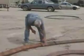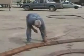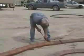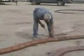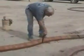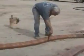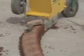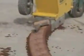Now you put the control joints in, every 3 feet. But the main thing is there where Cliff lifted that roller, you wouldn't lift it. You would leave the roller right at the end of the curb machine. Sam's putting it back now. If you were extruding away and going another 30 feet, Gerald comes back with his slate roller in front of that, and then you continue on with the diamond roller, and it loses no pattern. So it's continuous, as you can see.